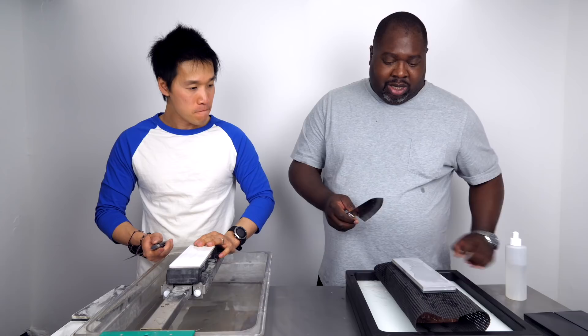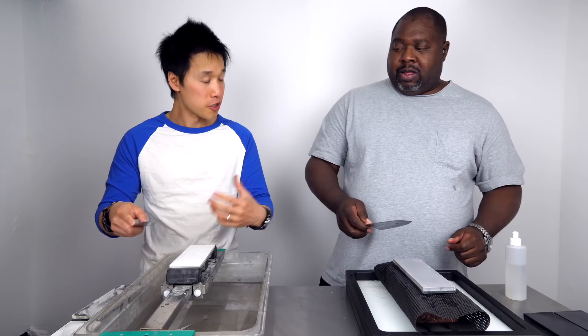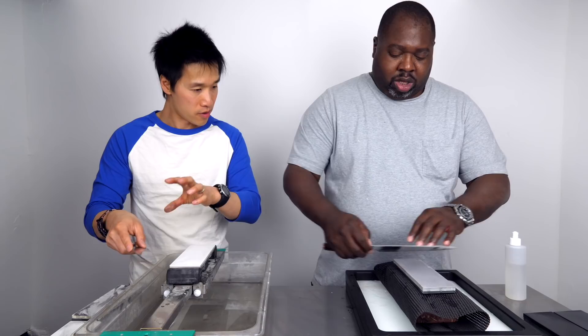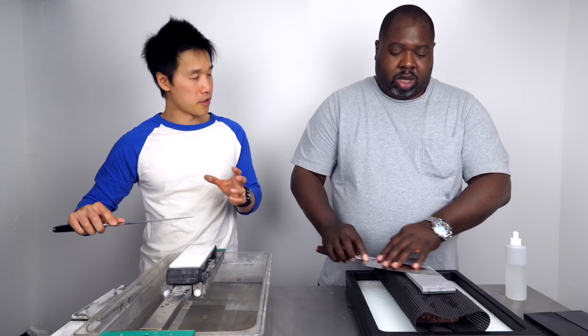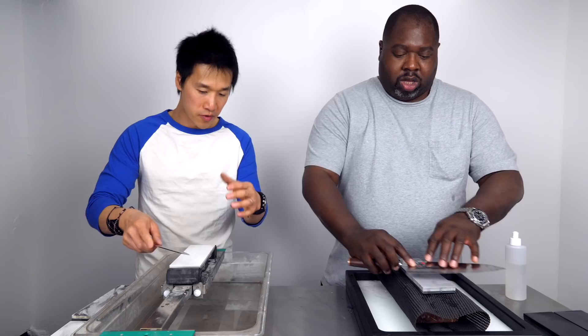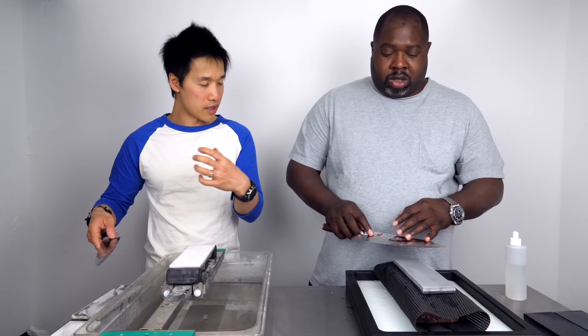The same thing basically — you're continuing where you left off but on a finer stone. Go from heel to tip and take your time, alternate back and forth. Your burr is technically gone at this point so you're polishing the edge, letting the stone pull off any micro materials still there. Over time the stone will pick up less and less material — you'll see fewer obvious scratch marks.